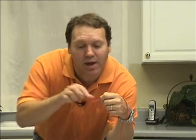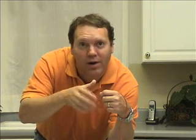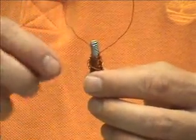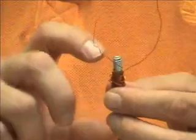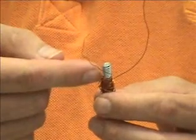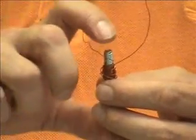So here's what's happening. If you take any piece of wire and you run electricity through it, the electricity will automatically create a magnetic field around that wire. It's kind of like a tube of magnetism that surrounds the wire. And that tube of magnetism actually affected our compass. We could see that that magnetism was changing the way the compass needle pointed, and that tells us that there's a magnetic field that's been created around this wire. Now let's say you take a wire and you wrap it around a screw or any other piece of metal. All those tubes of magnetism overlap and they line up along the length of the screw. That creates a very strong magnetic field right here in the center. We've created a magnet out of electricity.